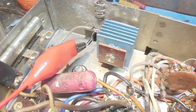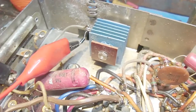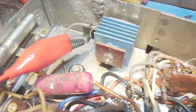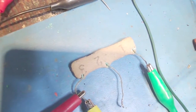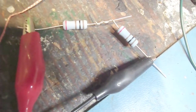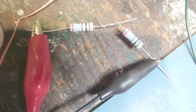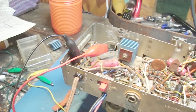I think we can say without hesitation we've got a defective selenium rectifier that we'll probably need to replace anyway. Here's what I've just done: I basically took the anode side of the selenium rectifier and snapped it off, and I've added a 1N4007 — good old general purpose 1 amp diode. Instead of running it through the original 130 ohm resistor, for added safety I have two 100 ohm two-watt resistors in series for a grand total of 200 ohms. We're going to bring up the voltage again and see how that works out.